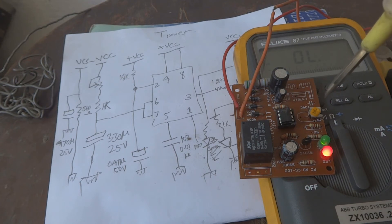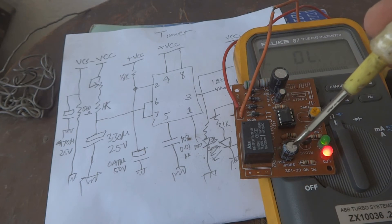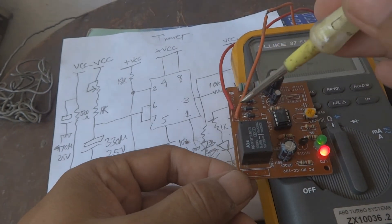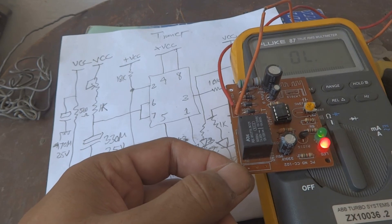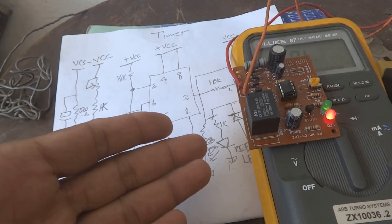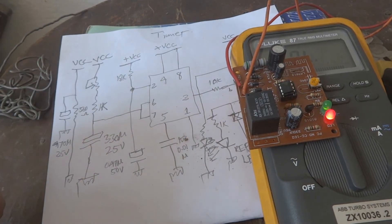From here you can make adjustment from a few seconds to a few minutes — up to six or seven minutes with this configuration of resistor and capacitor values. If your requirement is not fulfilled with these settings, you can replace the capacitor with a bigger value for a bigger delay. I demonstrated this circuit so you understand what it is doing and how it behaves. In the next video I will demonstrate putting this circuit into another system. You can also go to my blog linked underneath for more detail.